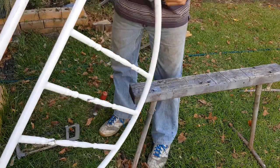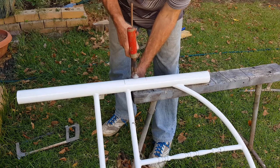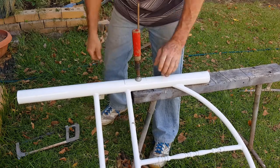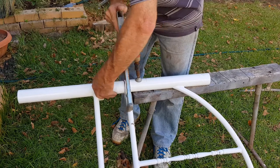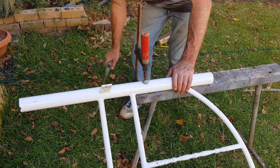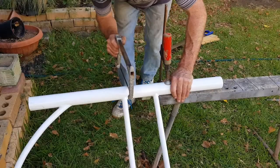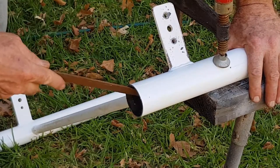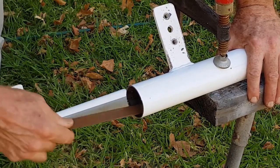The hacksaw blade — this is an 18 TPI, or teeth per inch — probably should have used a slightly finer one because this is fairly thin gauge metal, but it cut through fine. Just make sure the tension is nice and tight on your hacksaw, otherwise you won't get a straight cut and it can jam and snap. Cut through pretty easily, then swing the thing around, clamp it on the other end and cut through here as well. As you can see it's just below that second cross rail, which will work out quite nicely. That gives me the front legs for the seat. I've got a half-round file here just to take any burrs off on the inside and outside — it'll also make the plastic stops easy to tap in.